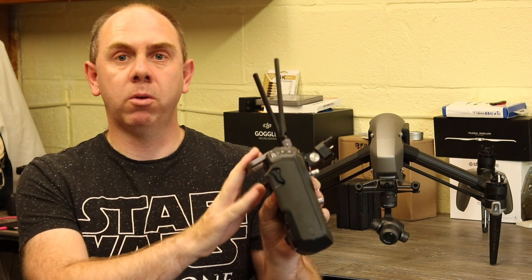The tests still show really good clear results. You might ask why you'd want to use 1080p mode — well, if you've bought this remote controller you might want to use it professionally in a broadcast situation. The remote has an SDI output as well as HDMI, so if you were outputting to a large screen or a broadcast truck you'd want that 1080p mode for the best possible live feed, since in those situations the live aerial image is often more important than the recorded video. When selecting 1080p mode you're much better selecting it in custom and manually setting the bit rate, which controls the quality of the image.